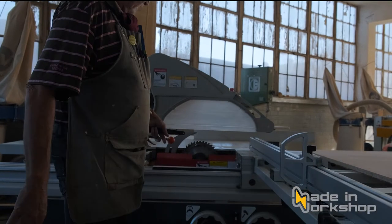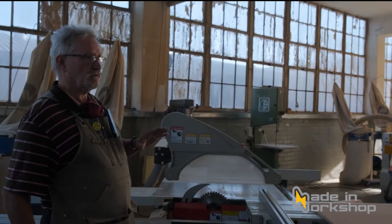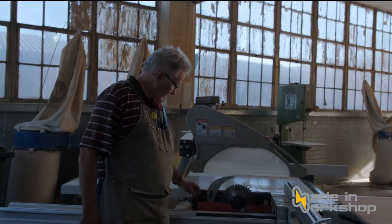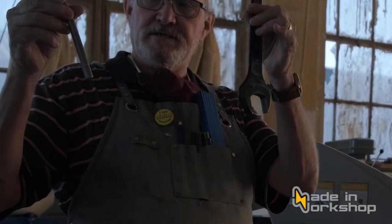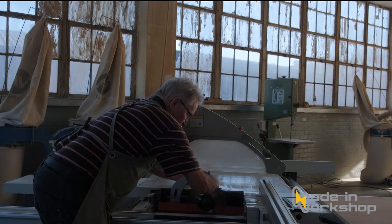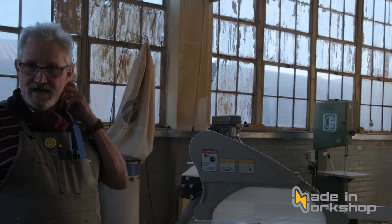Before I even open that panel, I'm going to hit one of the safety switches so no matter what happens I can't accidentally turn the saw on — and no one else can; they have to physically pull that switch up. There's a lid in here with a lot of debris. We have two items for a panel saw: this bar and the main spanner. Saws of this nature have a left-hand thread, which means the old adage 'lefty loosey, righty tighty' is opposite here — left tightens it, right loosens it.